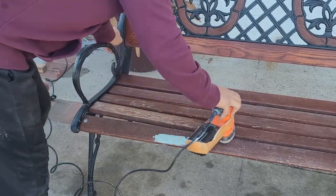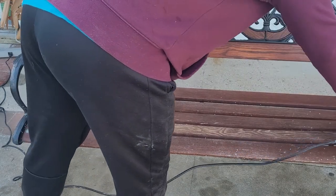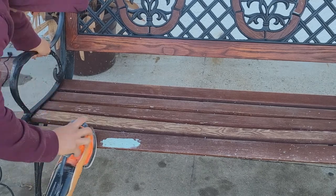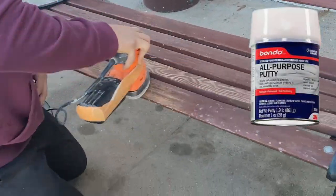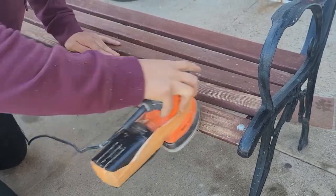This is where it's very useful to have an electric sander — the machine makes the job a lot easier. We're going to start by removing the old paint first. This blue spot in the front is where there was a big hole, so we put bondo on it and we're going to let that dry before we sand off that piece of the wood.